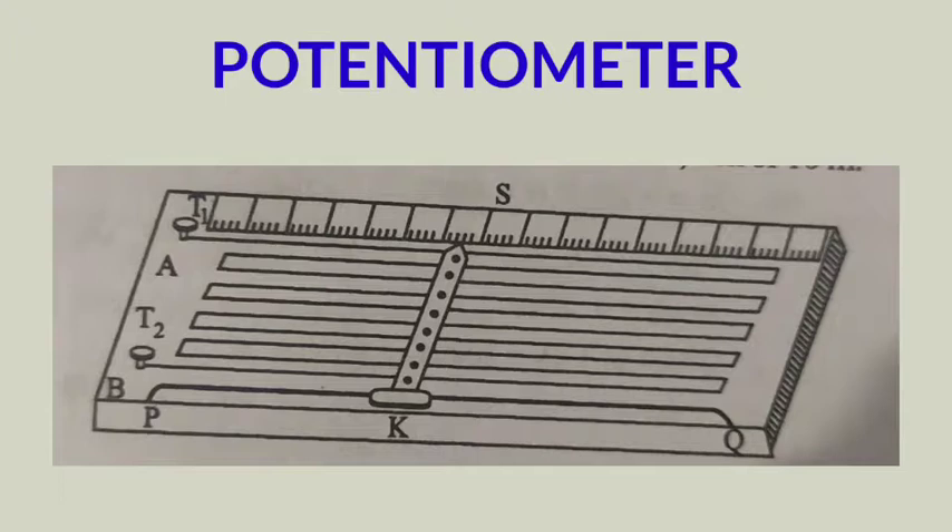In this way the total length of wire is four, six, or ten meters, depending on your purpose. The diameter of the wire is uniform throughout the length. Two ends of these wires are connected with two connecting screws A and B. The jockey J is such that it can be shifted on the plank and can be connected with any part of the wire, and can be moved over the wires anywhere as you wish. One end of the jockey remains continuously in touch with the metallic thick rod PQ.